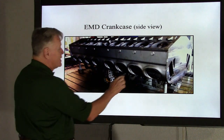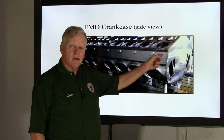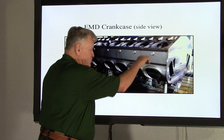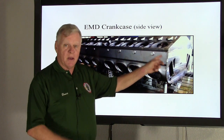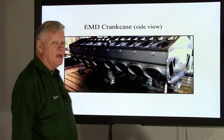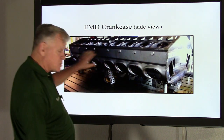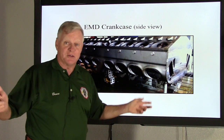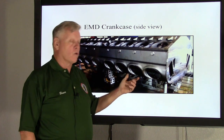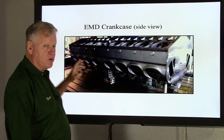What's really cool about this shot: right here we have a molded casting from the factory that has not yet been machined. This is where the compression relief valve — or what's known in the railroad industry as a flash cock — will go. It'll be machined out, threaded, and have a place for a seal, stem, and housing. The compression relief valve, once they're all open, allows the engine to rotate easier because you're not working against the compression of each cylinder. Also, when you open that test valve during an engine evaluation, if there's any liquid accumulation — such as fuel or water — it will come out of these openings. That's a good troubleshooting tip.